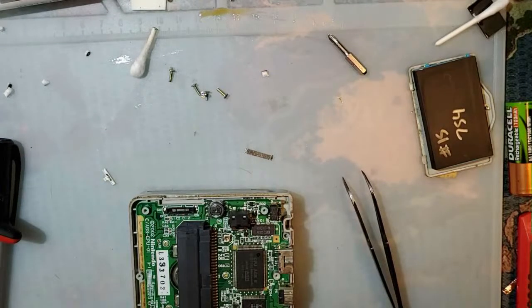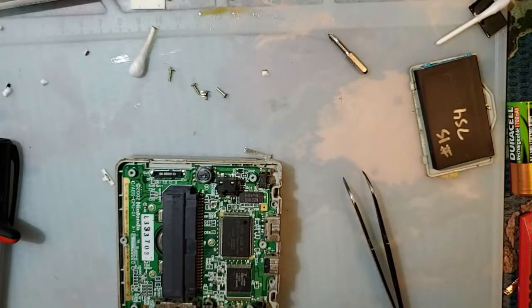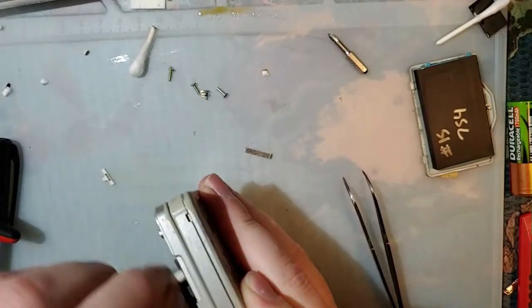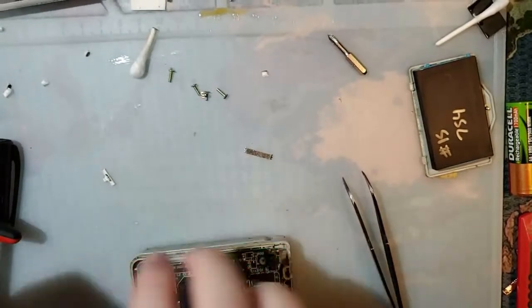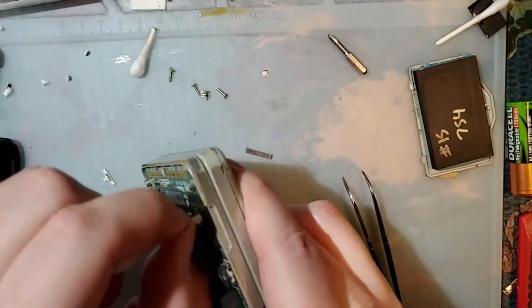Alright, so that worked much better, as you may or may not be able to see. Again, I only do that on the worst of the worst. And then we gotta clean it up like normal. Make sure all that's out of there, because baking soda is an abrasive, and so by doing that, I literally wore away at the switch, and I want to make sure that that can't continue to happen at an accelerated rate, at least.